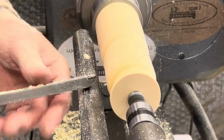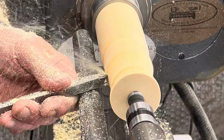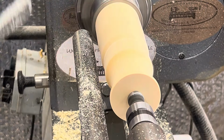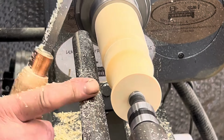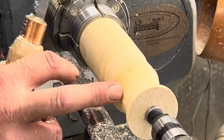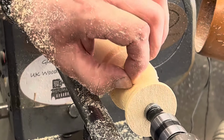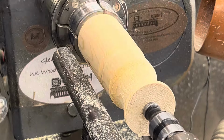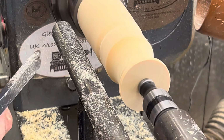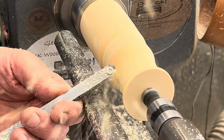Now, like I say, if you want to push in flat like this to get it, that's all right, but you're going to really tear that wood up. I'll just show you. Look, this is pine, and you've all seen it. You're going to get this, okay? And what it actually does, it doesn't just tear it, it really rips fibers out. And it leaves it quite deep, so you're going to struggle to get rid of it. So if you can help it, don't do it. Just roll it over and come in this way.